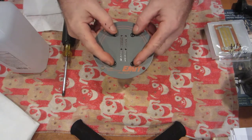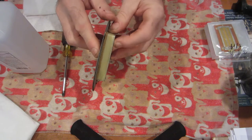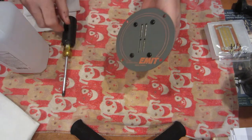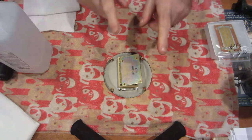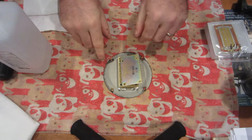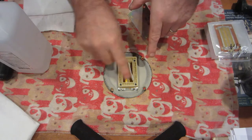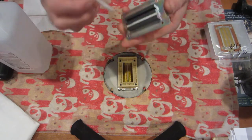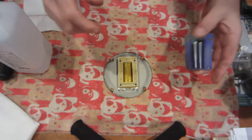The way you start is you take these four screws out. These four screws are only threaded through this plate on the back, which is very thin. We're going to back the screws out but not take them out, because there are opposing magnets on both sides. To keep everything aligned down where it's fragile — the ribbon — you pull this plate off. We do have a piece of cotton here which we'll get to in a second; we'll stick it back in there so it doesn't get lost.